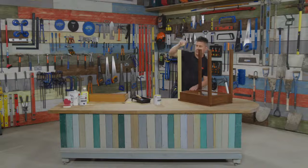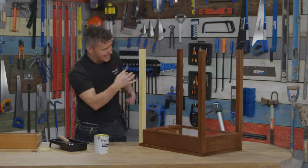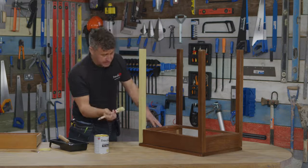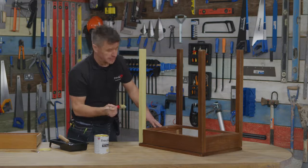You're making sure you're applying an even, balanced coat right the way around the leg. Because I'm using a very light colour called Hot as Mustard going onto a dark hardwood surface, you might still see a little of the existing colour coming through — but don't worry, the paint will dry flat and you can easily apply a second coat if needed.